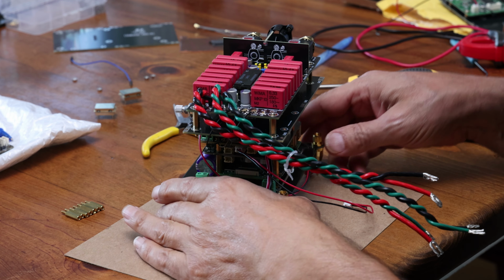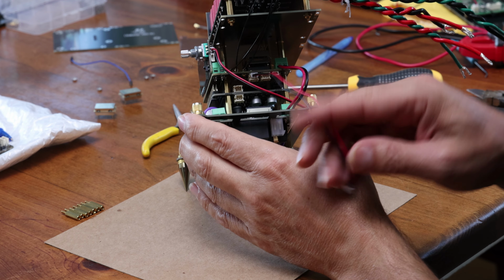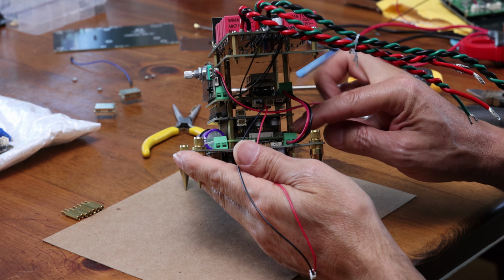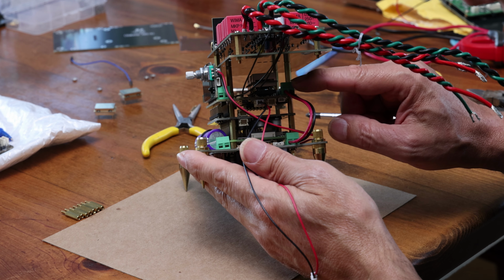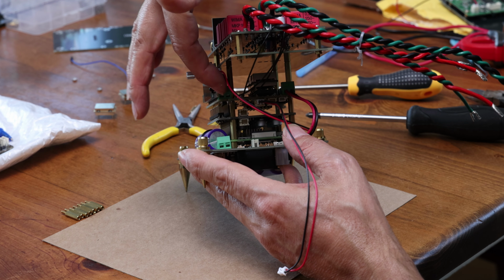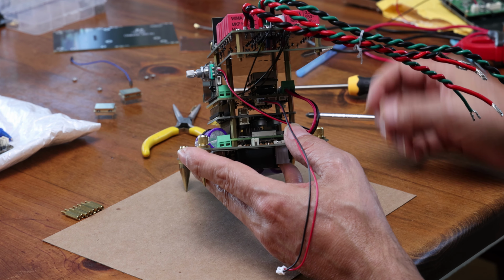Now, what are all the rest of the cables for? I went through them when we built the streamer, but I'll just quickly do that again. So you've got a 3.3 volt here coming from the Ropieee to the 54Q7, so that's a 3.3 volt. There is nothing on the 5 volt side. You don't need to connect anything. These guys are already pre-connected internally.